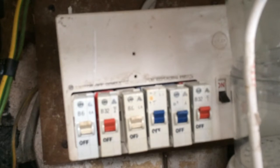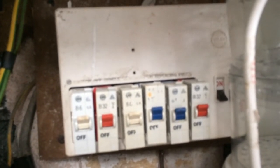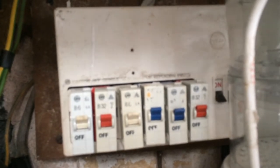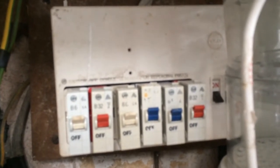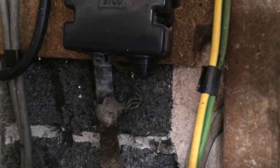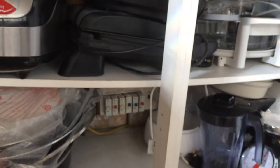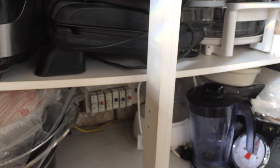There's the old fuse board that we're going to replace. It's got no RCD protection on this board, so we're going to put in a new consumer unit with RCD protection. There are our meter tails and you can see the old braided cable. That one needs a bit of an upgrade. It's right in this cupboard so I'm going to take this shelf out to get access to it — I'll probably do a little video update on that later.